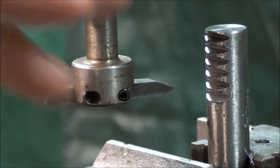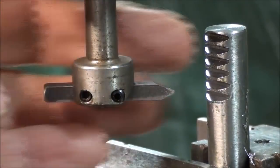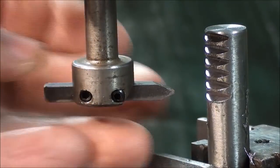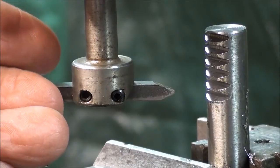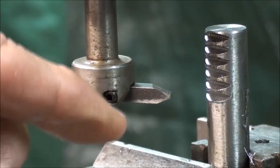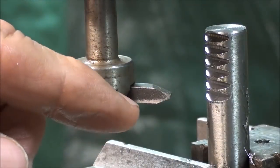If you were to encounter strange noises, or a change in the frequency or the amount of noise as you continue here on any kind of project, stop immediately, investigate, and see what the matter is. Because usually if the sound changes, it's either that something has gotten loose - the tool or the work - or you've lost the edge on the tool.